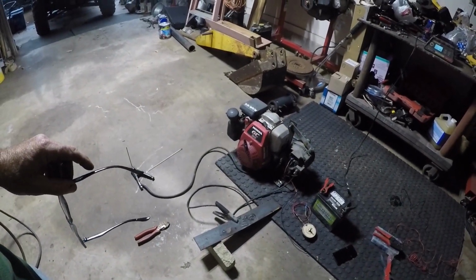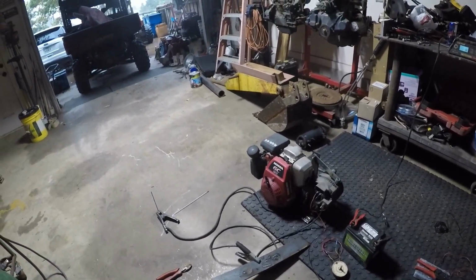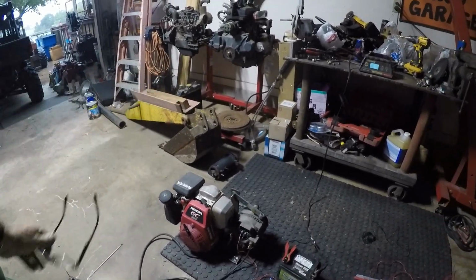The other difference was, before, when you welded with it, you could definitely hear the difference in the tone because it had a real high-pitched, whistling noise. If you go back to my old videos, I have a couple of videos where I had this exact alternator set up in a little makeshift homemade SA200 welder, and you could hear it really whistling loud. That's because it was welding 3-phase 180 hertz, so it was a really high frequency weld, and I can't hear that on this. It could be just the muffler, or lack of muffler. Well, it's got a muffler, it just needs a different setup.